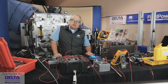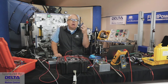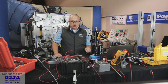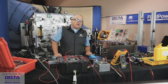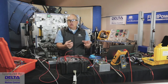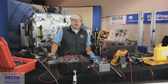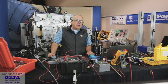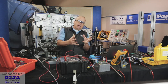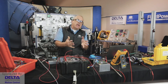Quite often if there's an issue where overloading a hydraulic pump might cause pressures and horsepower loading on the prime mover, a diesel engine, so great that there is the possibility of stall damage to a diesel engine, then quite often that's a part of a scheme called horsepower limiting or torque limiting, which is sometimes manual linkage inside of a torque limiting pump. But since we're talking about electronics today, the electronic version of that is usually about a tone wheel on the drive shaft of the engine that is being monitored by a mag pickup or a Hall effect sensor. And so then quite often the electronic control gear, the processor, the ECM, which is a mobile world version of a PLC, right? Typically that is reading the RPMs.